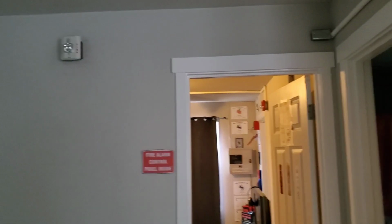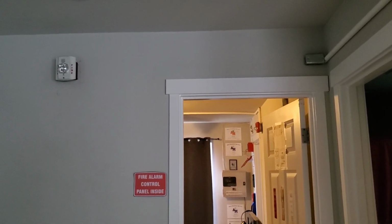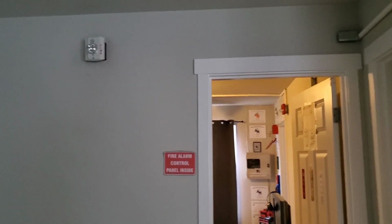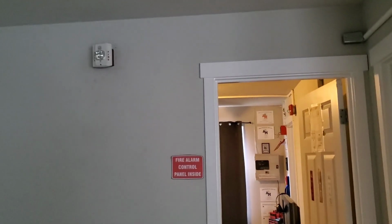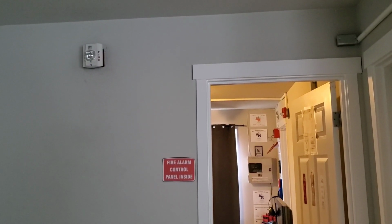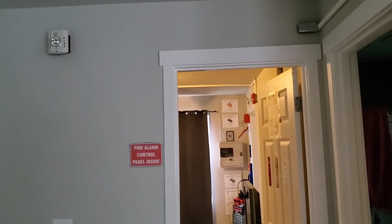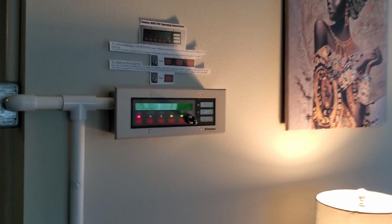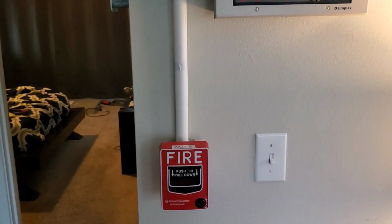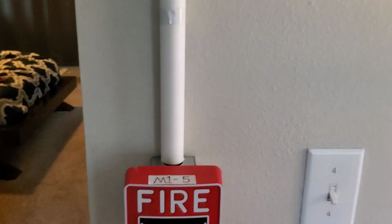The 9840 and the EH-EL1 horns are both tied into the audible circuit, which is set on code 3, and then obviously, like I said, the rest are on the Smart Sync module. But even then, they're not gonna be in sync. So let's go ahead and re-alarm a couple of times. I'm not gonna sound it that long for these last two because I think that first one was pretty lengthy.